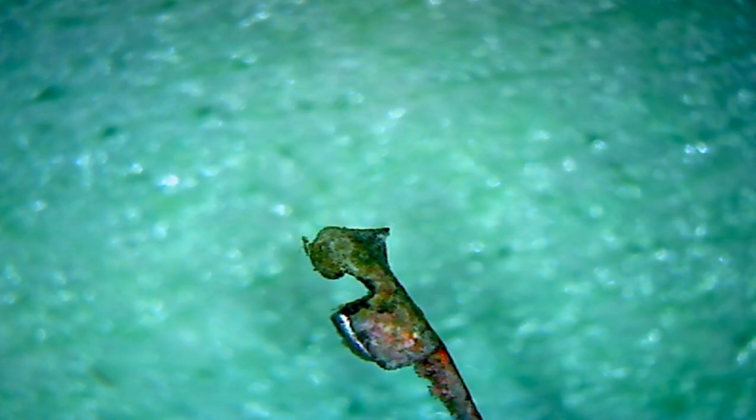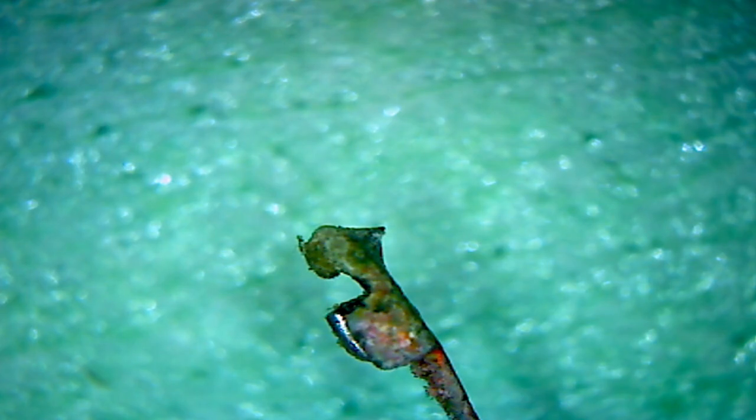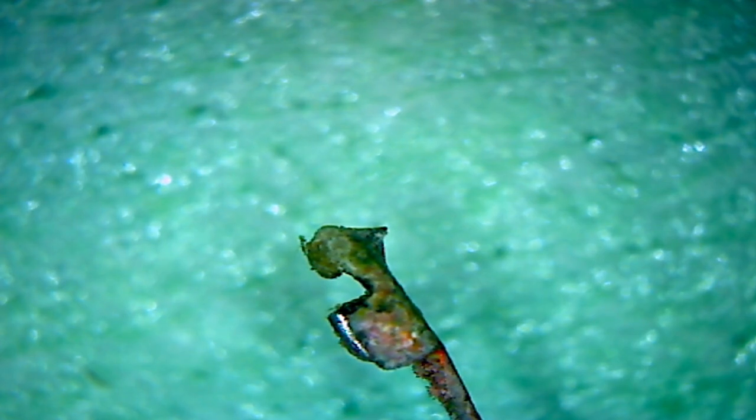Again, what exactly are we seeing there? Pretty sure that's a totally worn out needle. So needles wear out in a couple of ways. One is they physically wear down in the groove and get smaller and smaller and change their shape. Eventually they don't really ride in the groove properly. Another way is the needle gets broken right off the end, right off the holder, through some accidental rough handling.